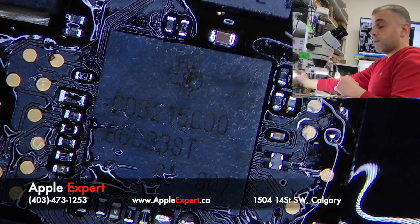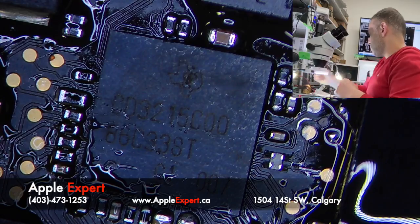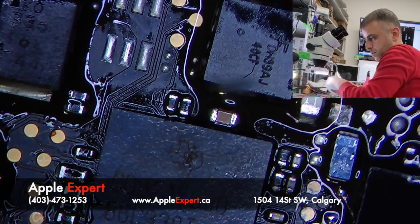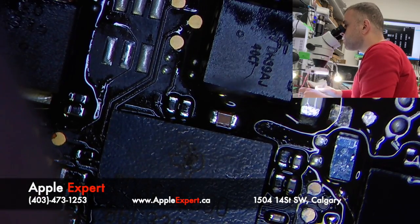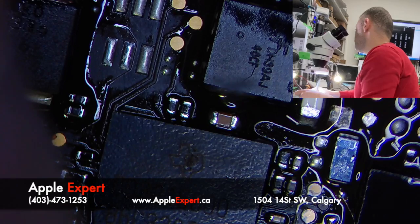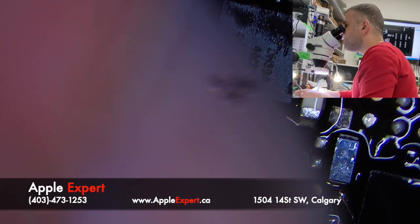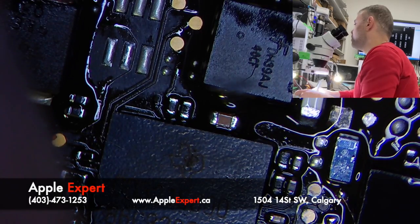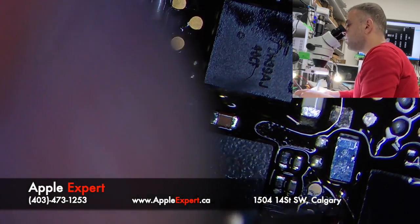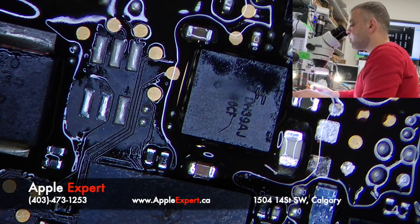So before I inject power, I would like to see what the diode mode reading is for the capacitor here. We have 0.33 volt. I'll check his brother here. 0.33 volt. 0.33. My wires are still there. My other wire is still there.